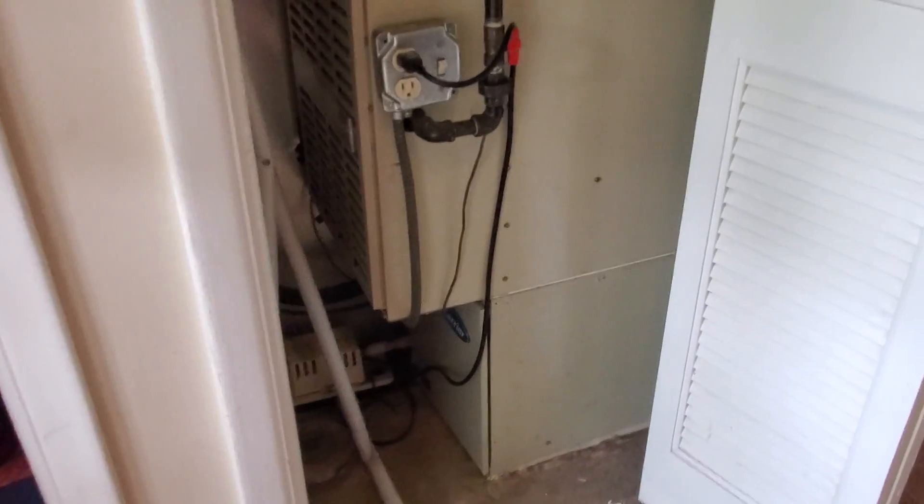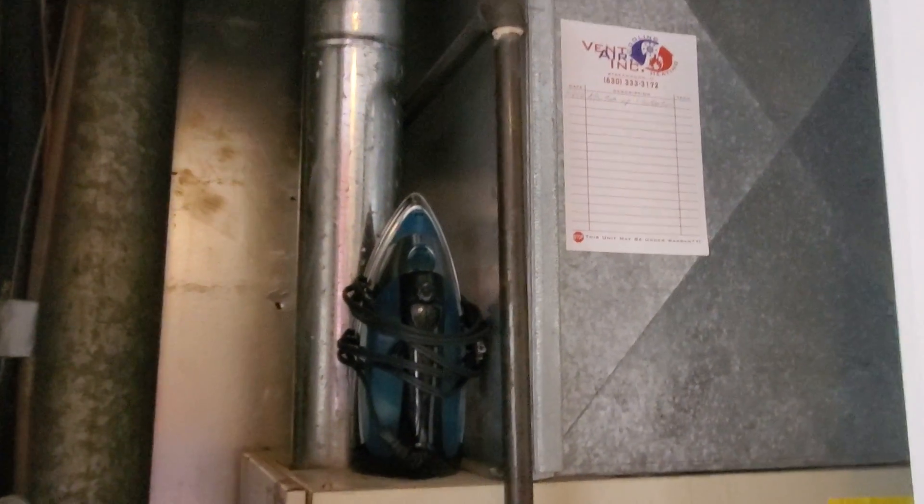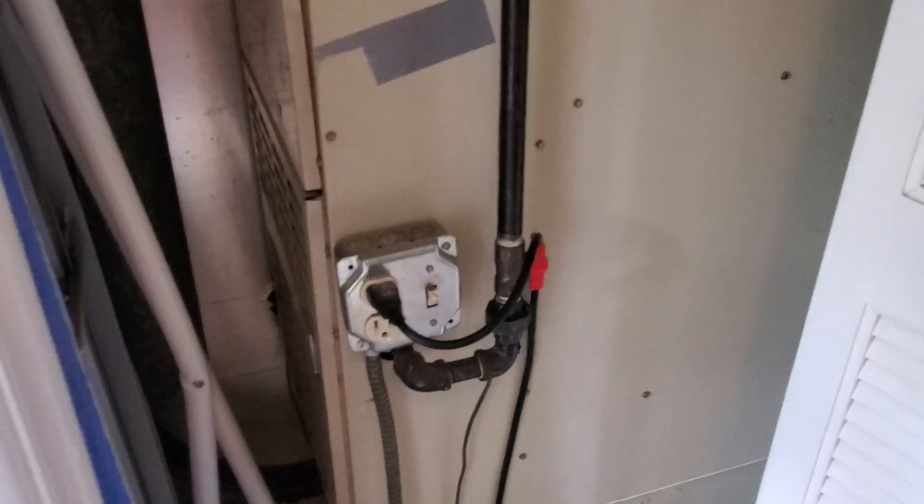It's 17.5 inches wide. You can see a low profile condensation pump — need to update that. This is a 17.5 inch wide, 90,000 BTU, 80% efficiency unit. See the nice tall plenum. This has a filter inside the plenum. We are sticking with 80%. You can see gas and electric.